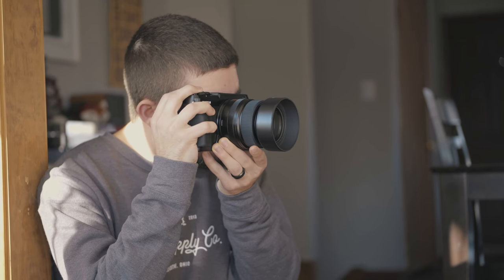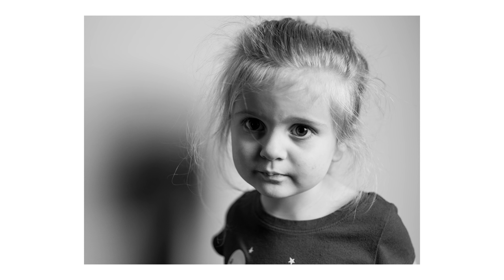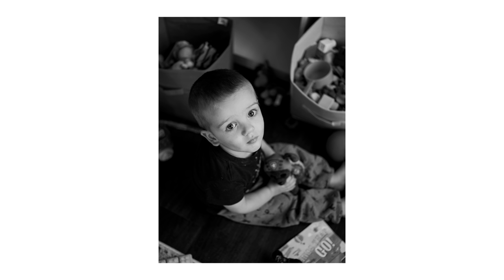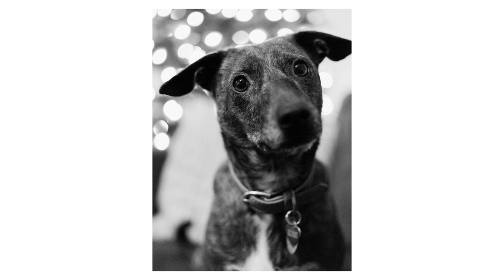I tried to use this camera for my style of shooting all around. In low light, focusing on the kids as they're running around the house, the autofocus is definitely not as snappy as my X-T3. A lot of times it'll kind of go a little bit past focus and come back and then lock in, whereas the X-T3 just meets focus pretty much automatically. There's definitely some time where you're going to have to wait on the autofocus a little bit more. But I still think it's definitely usable. One thing that really helps the autofocus, especially for portraits, is turning on the Face Detect and Eye Detect autofocus. It finds faces really quickly — that's one thing I love about the Fuji system — and I was blown away by how much quicker it focused whenever it knew to track the face or the eye. The manual focus is nice and smooth, and with focus peaking, it's really hard to miss focus.